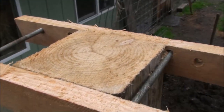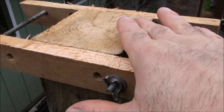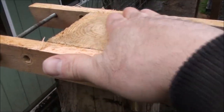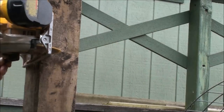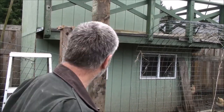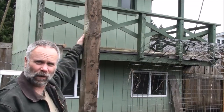Well, that was probably one of the poorest examples of sawing off a post I've ever seen. The top of the post was right at the edge of not being able to hold a kerf — I didn't have any wood standing up above, so the wood just kept breaking away and causing my saw to lift up. That's my excuse, but anyway the guide actually worked real well in helping me achieve that flat top. Here's the preferred way of cutting those off — a lot faster and easier to cut. I'll put the blade into the cut and just keep following this around.